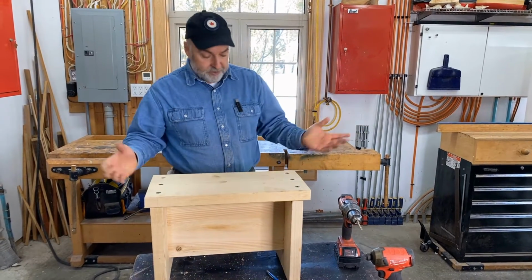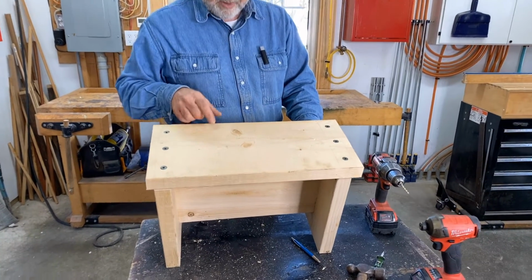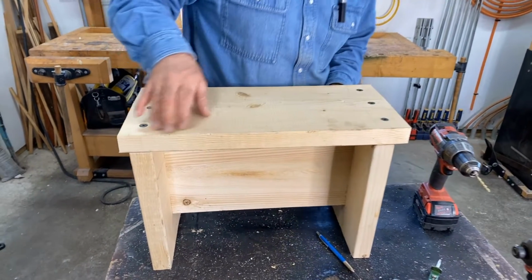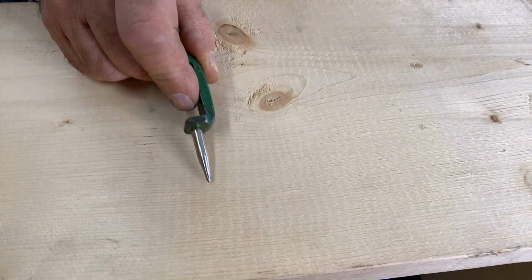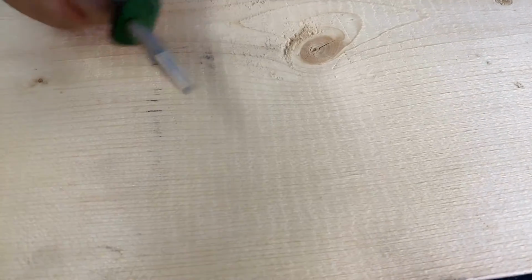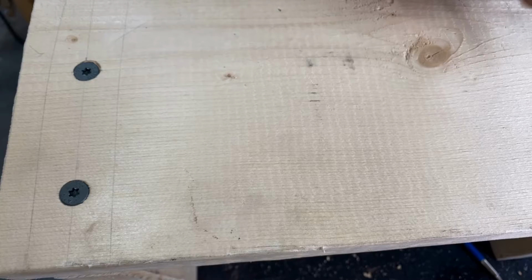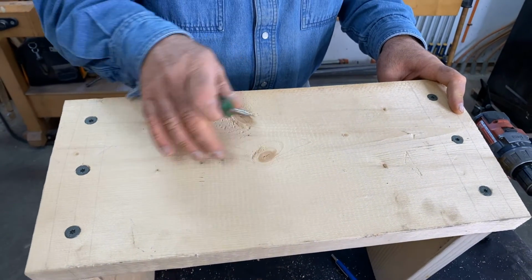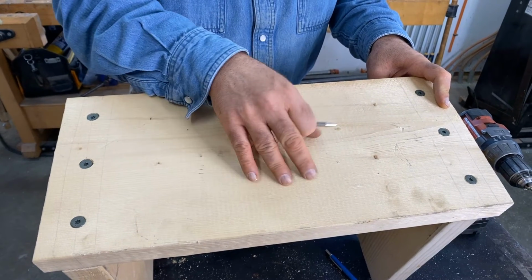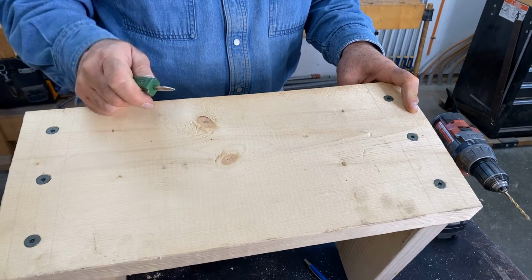And I mean, the first reason is because the wood's kind of rough. And you can see it here. We've got planer marks. You can see them, the lines here. That's because this surface was formed by a series of scallops, a series of curved moves from a thickness planer, that turned it from rough lumber to smooth lumber, or planed lumber it's called, but it's still not all that smooth, at least not for furniture use.